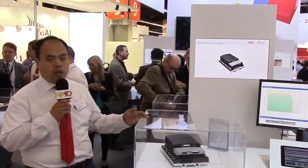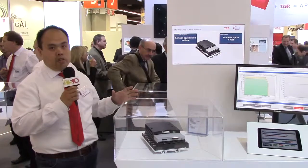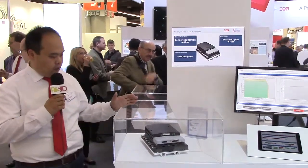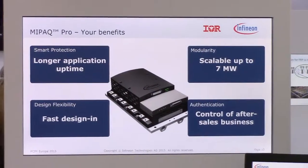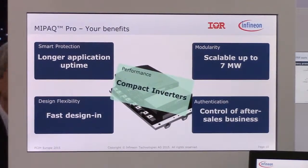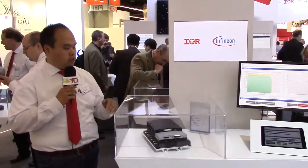This is a very compact design with high power density, capable of up to 1600 ampere output in just a small package. This is single-phase protection. Unlike a standard IPM, this is an intelligent IPM — not only a driver, IGBT module, and heat sink inside, but including much more. It is fully protected.